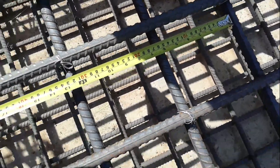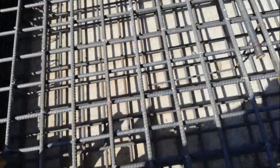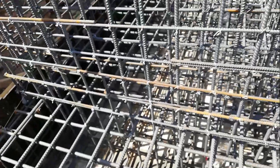The reinforcement spacing here is 15 on this side and 15 on the other side, so total 30. We have got 15 centimeters center to center spacing. So the thickness and reinforcement are okay.